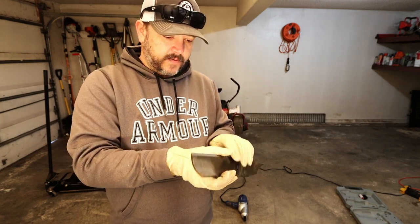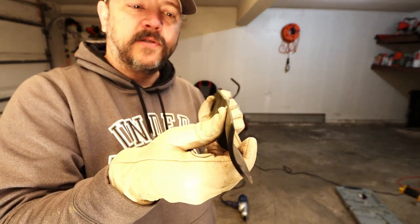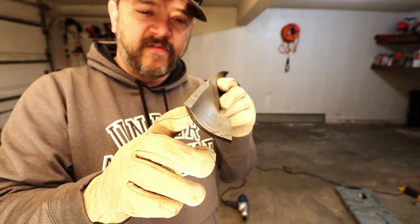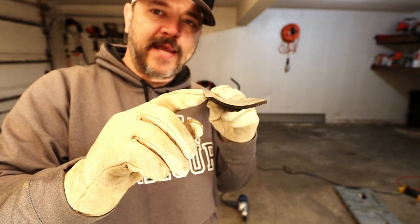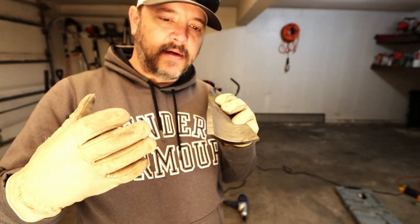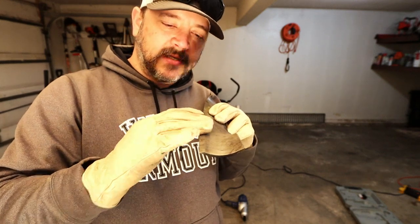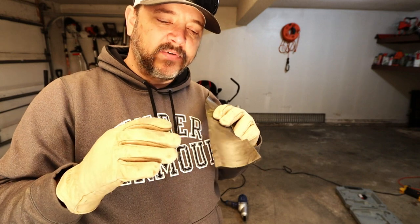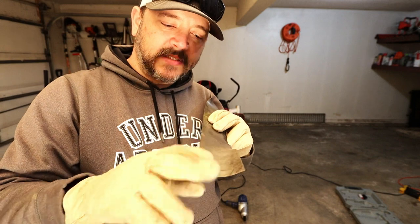When it comes to sharpening blades, even though these are fairly sharp, I do like to have my blades very sharp, so I'm going to run a file along these. One important thing: you're going to want to stay with the exact same angle. If you change this angle, that's going to change everything about how your deck is designed — it's designed to cut at this angle with this blade and this lift. So be sure to go about this the proper way. Don't take too much off. Keep it at the same angle.